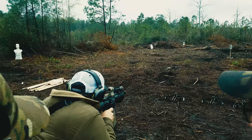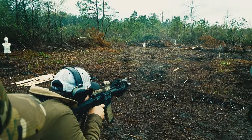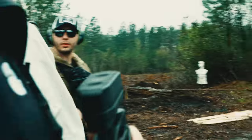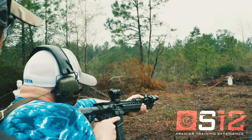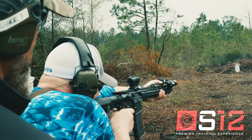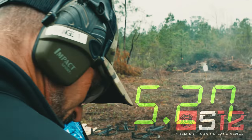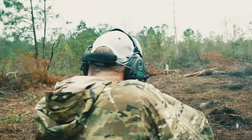So when we go into the AR550 steel, it's a much stronger material. It's higher on the Brinell hardness scale, and that equates to the strength of the steel. And we also buy just from certain manufacturers of this AR550, and the specification window on the AR550 is much tighter than the AR500. So you're gonna end up with a better product every single time.